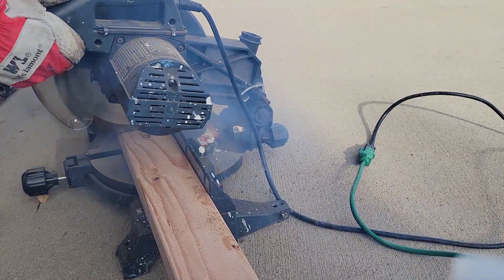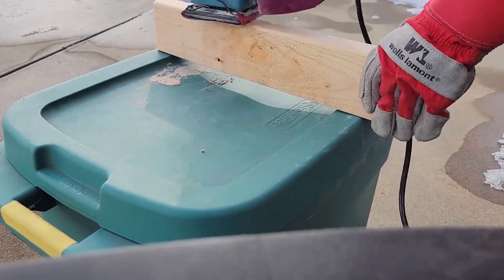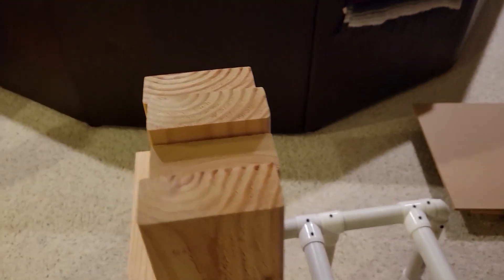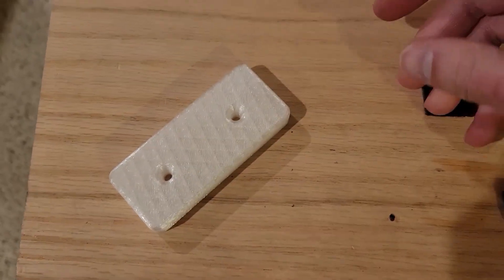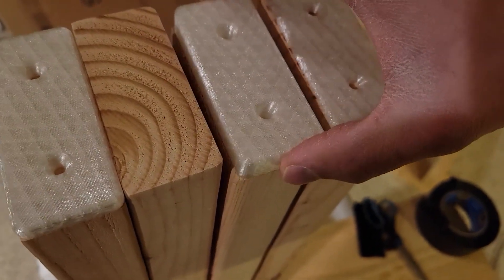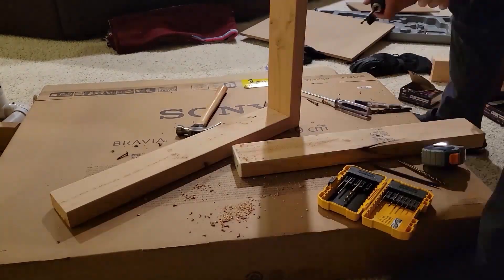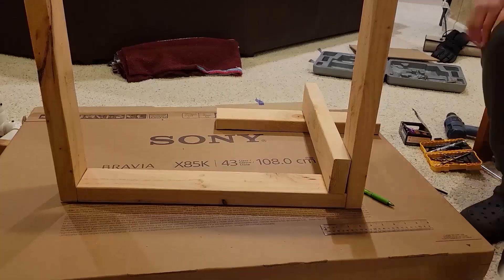Now that I had a list of the best mathematically possible cuts to make, I went to the store to get some more wood. I didn't like how the guy operating the saw was making my cuts, so I finished the rest at home. Then, in the same way I did previously, I cleaned up the wood with the power sander. Apparently plus or minus half an inch is the tolerance you could expect from him. I needed these lengths to be close to exact, so I made some quick measurements and printed some spacers to get the right length. Now I'm just going to speed through the construction of the wheel base — it is fairly similar to what has been done before. I just want to make sure to depress all my screws to get more thread engagement and hide the head inside the wood.